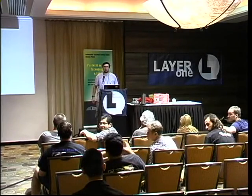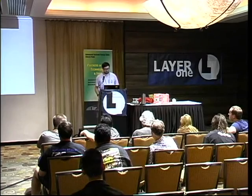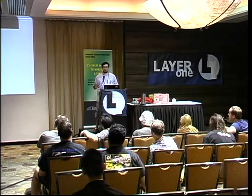It's pretty interesting. How do you test your electronics for those extreme temperatures? That's a great question. I should have put it in there, but the talk was getting too long. Essentially, there are different ways you can do cold testing. The cheapest way is dry ice, or just get some towels, pull the peas out of your freezer, wrap your electronics around it, and let it get cold.